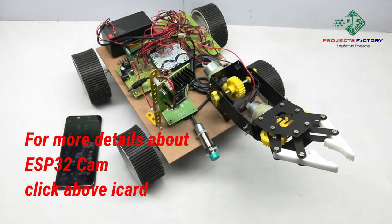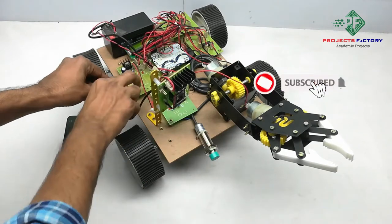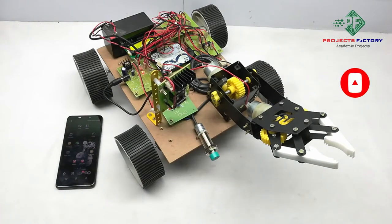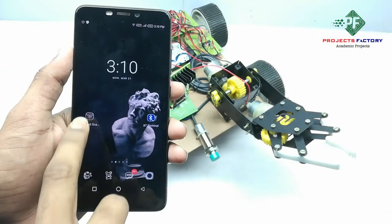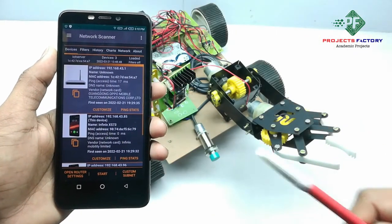Now power on this. After powering on this project, the ESP32 CAM connects to the Wi-Fi network and gets an IP address. We can know the IP address from a mobile app which is available in the Play Store. Here, the app name is Network Scanner app. Now we have to open the Network Scanner app. This app link will be provided in the description below.